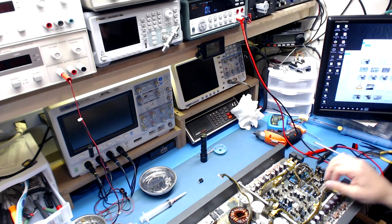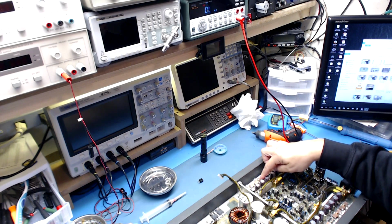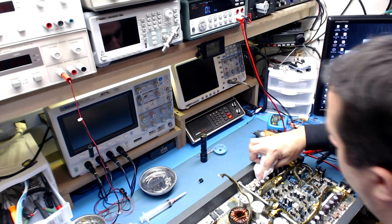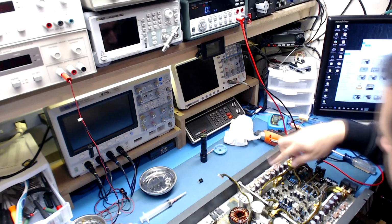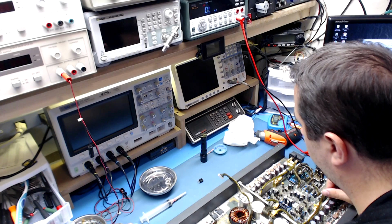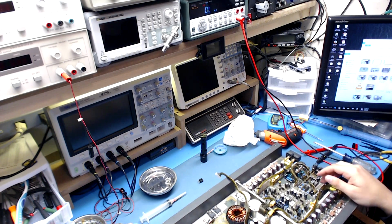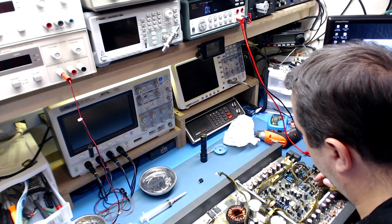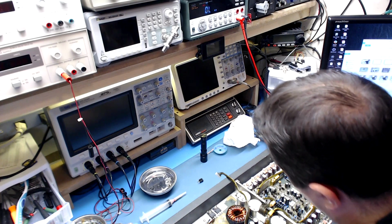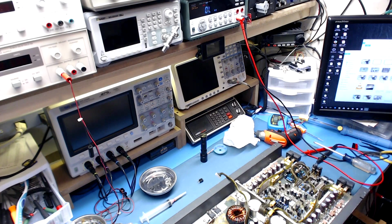So components are available, and if you, like I said, throw an eBay FET into this channel, you might as well throw gas onto a fire, because there's no way those eBay FETs are going to act normal along with these older original FETs. Those eBay FETs are ridiculously way out of spec to run in a final section of an amplifier of this class. So yeah, like I said, don't buy crap parts. All right, so I guess we're just going to be removing all those FETs and start there.